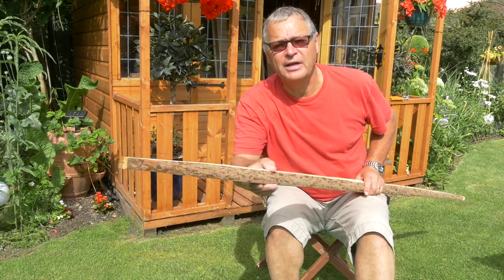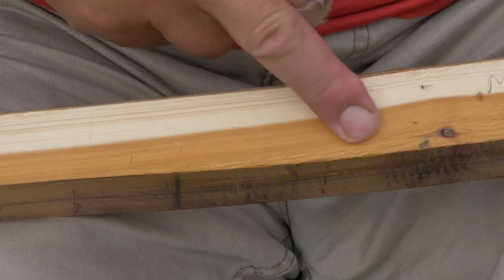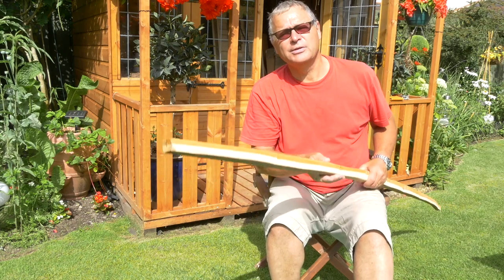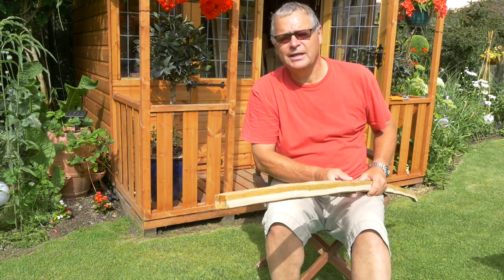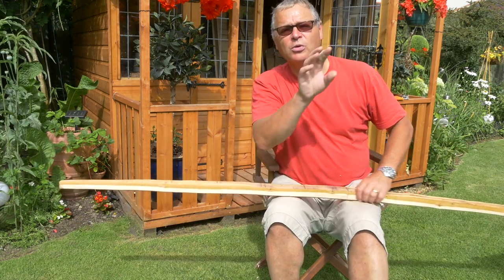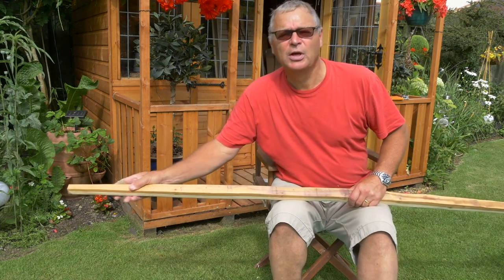I have some concerns about the thickness of the sapwood in relation to the heartwood. The heartwood is the red wood; the sapwood is the creamy-coloured layer there. I don't want to reduce the sapwood yet, nor reduce the heartwood. So today I'm going to be rounding the corners of the bow and taking it down from the square section along the entire length to a more oval, inflated-box shape, doing this with a rasp and a spokeshave.